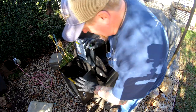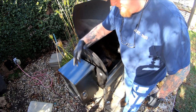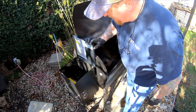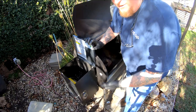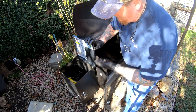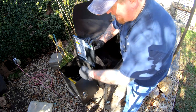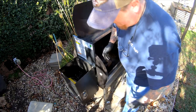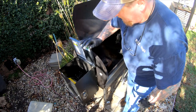After I've done that, I think it's been pretty well prepped for the next set of pellets. I don't really have an effective way of getting the pellets out of the hopper auger screw. So hopefully during the smoke setting when you first turn on your smoker, those will funnel through and only the best pellets will come along after that. I've never blown it out with air, never had to get inside there to really clean them out. I just use the shop vac from both ends and try to suck out as much dust and impurities as I can, and so far it's been working pretty well.